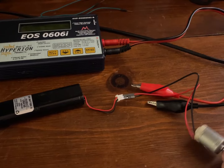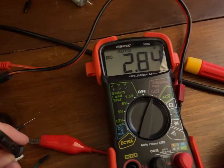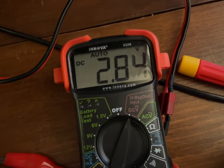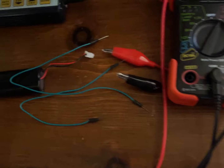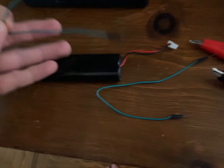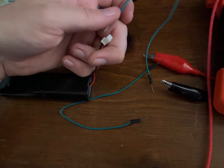So what we want to do is take this down to zero volts. Let's check what the voltage is. We have a voltage of 2.84 volts. With it being such low voltage and such a small battery, I'm just going to jump the two wires together.